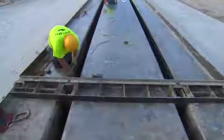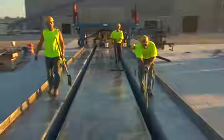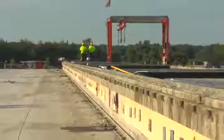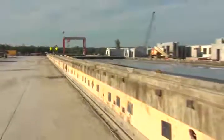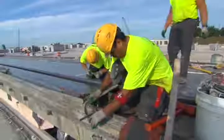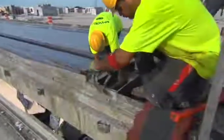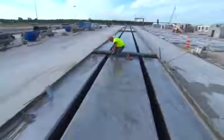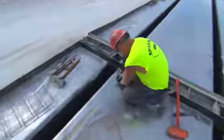The first part of the process is setting up of the form. A thorough cleaning of the entire form is done with basic labor and appropriate cleaning equipment. The side forms are set — in the case of a typical double T, the forms may be fixed forms with an appropriate draft to allow for easy stripping. Once the bed is cleaned, it's ready for setting up today's cast. This particular bed is set up for five double T's, each about 60 feet long, with a total bed length of 400 feet.